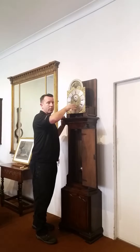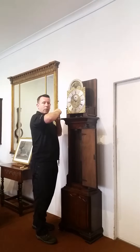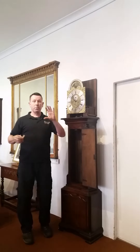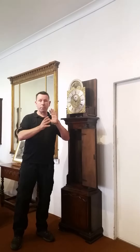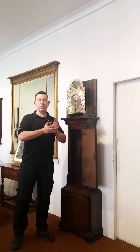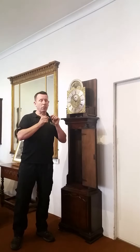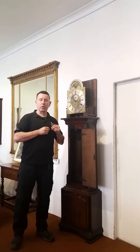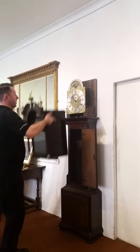That's where the wedges come in handy. If it's slightly out of beat, listen to the clock — if it needs to be lifted left or right to put it in beat, you can slide the wedge underneath just a little bit. This will lift up the actual works on that side, which saves you having to mess about with the crutch at the back. As soon as you bend the crutch out of position you're really chasing the game, so if it's only fractional, don't move the crutch — just put the wedges underneath to balance the clock.